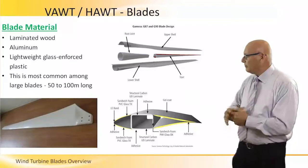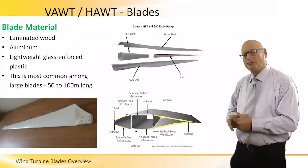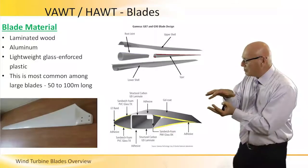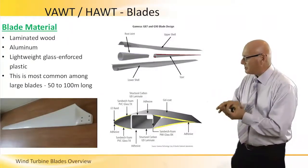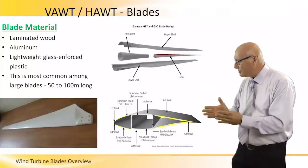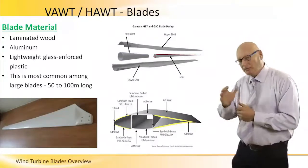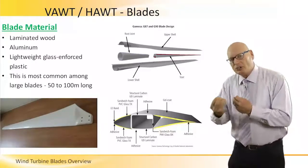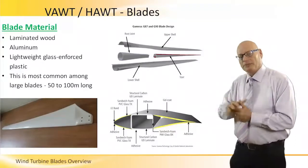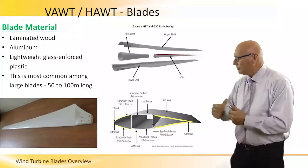And on the bottom right picture, we see an internal structure of the blade. It's a cross-sectional look. And we can see within the space of the blade, in this empty space, there are two supporting walls. These supporting walls are to reduce the level of internal vibration of the blade itself. The blade faces variations of the wind and variations of air pressures, and it would like to vibrate. In order to reduce the level of vibration, we put two supporting walls.